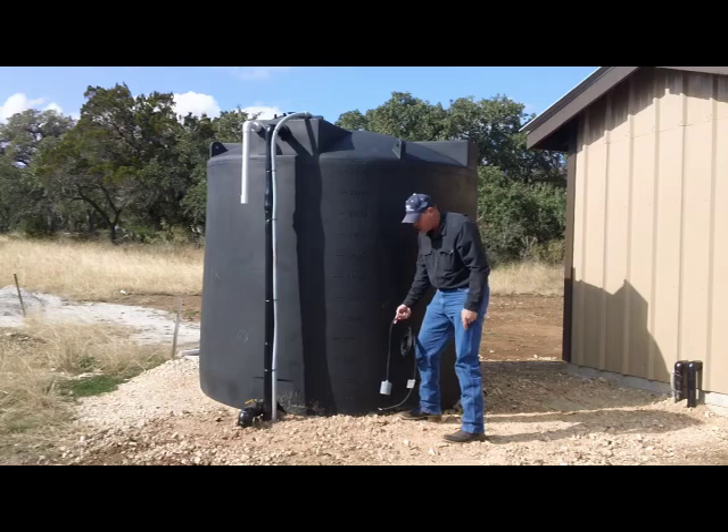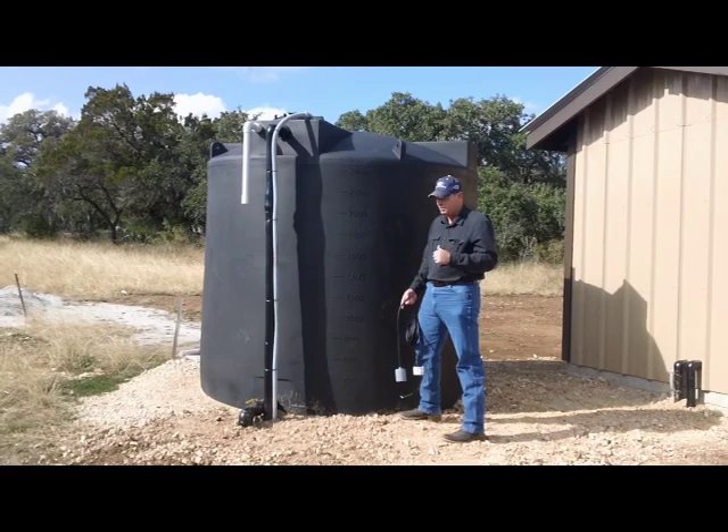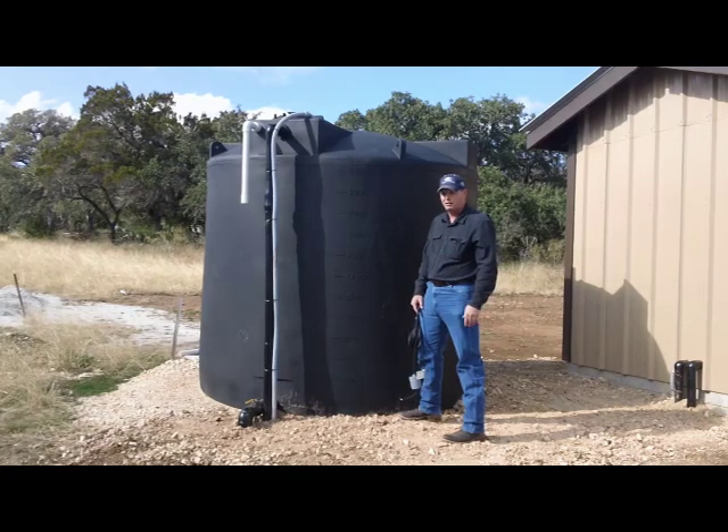We have another switch right at the very bottom. Just before the booster pump sucks air, there's a switch in there that cuts that pump off — that protects it. Don't mess with that one. If you get it too low, it won't protect that pump. You'll burn it up, and I'll have to come out there and sell you a new one.